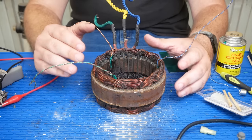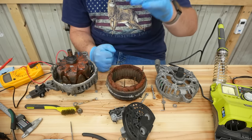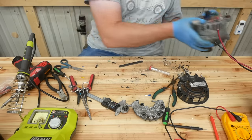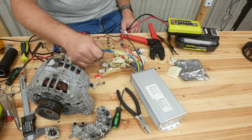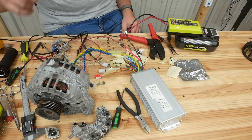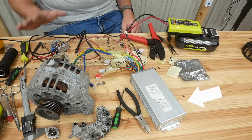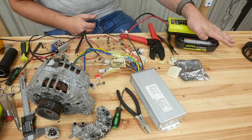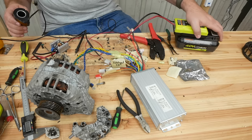I did take apart an alternator earlier that had six individual wires coming out of the stator — one for each end of each phase winding — that I had to manually wire into the delta configuration, but I ended up not using that alternator because I accidentally broke it. Now that my alternator has been converted to a motor by virtue of removing things, let's give it a test. My speed controller of choice — the thing that produces the three-phase signal to drive the motor — is this no-name 1,500-watt unit I bought off Amazon for about 80 bucks. It came with absolutely no instructions and all the labels are in Chinese. I've got a throttle to control it all.